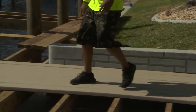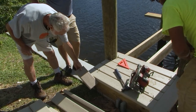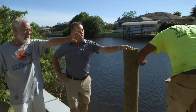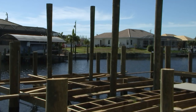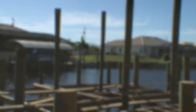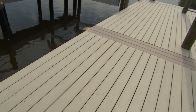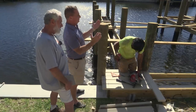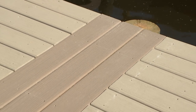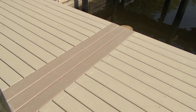Let's talk about the transition of the two colors — the two-tone. This is the putty color, and this is the harbor wood. They're going to come out from the front of Clint's property roughly twenty feet, then run three boards twenty-five feet long. All the carpenters have to do is header off that transition area — however many boards they want to use — header that off and screw the boards down. It's going to look absolutely beautiful.